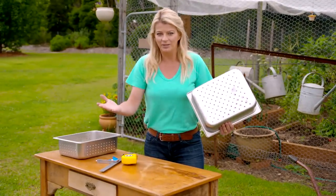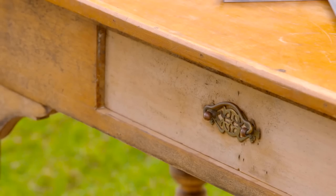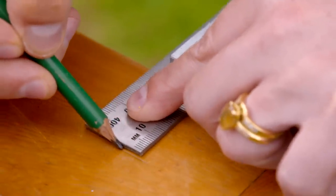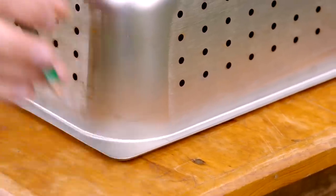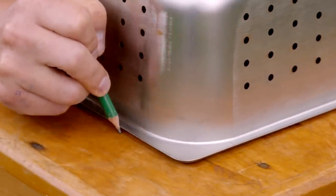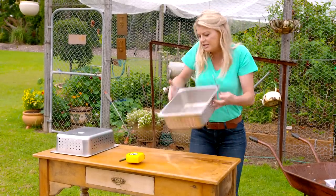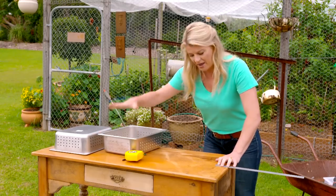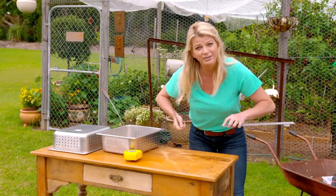The first thing we need to do is create some space for planting. I picked up these perforated pans from a kitchen supply place — we're going to put them on either side here just to give a little bit of clearance for those drawers. So let's start by measuring out some guidelines to make sure I don't cut into the under frame. Now those guidelines are in place, I can just trace around the pan. I'm going to come in another 10 mil from that original line so that the lip of the pan can fit snugly into place. Then it's just a matter of drilling some holes in the corners to get the jigsaw in and we're ready to go.